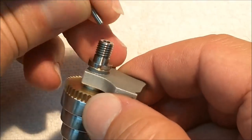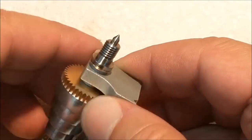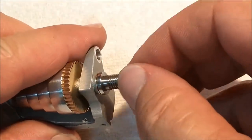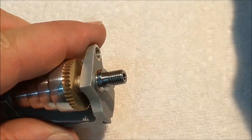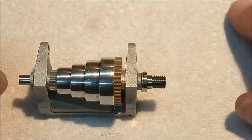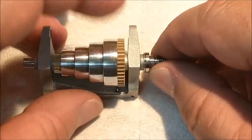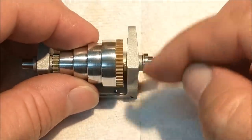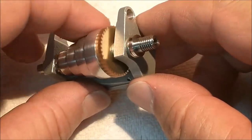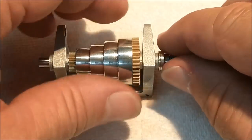The spindle does have the taper in it for precision between-center work. I think I'm going to sleep on that — struggle with that overnight. This may be a two-day video although it doesn't need to be. I am going to put the bull pin hole in it — threaded hole of course — and just mess around with this dimension right here and see how that looks.